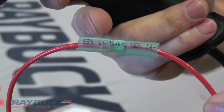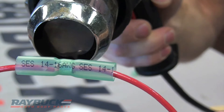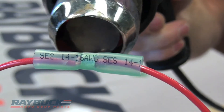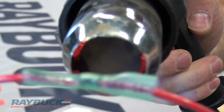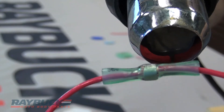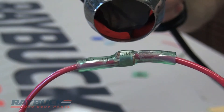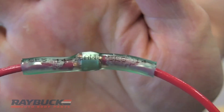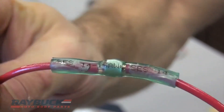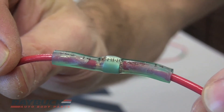And lastly we have the solder and heat shrink. What I did first was I put my two wires into the center and gave it a little crimp, and then I applied some heat. What you'll see is that the solder in the center is going to melt and then each side shrinks. The solder started to melt on the center section — it formed a nice tight connection, soldered the two wires together, and either side shrunk to fit the wire, giving you a perfect connection that's never going to come apart.